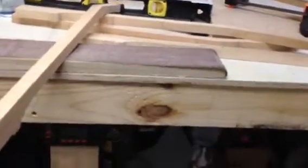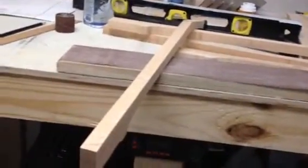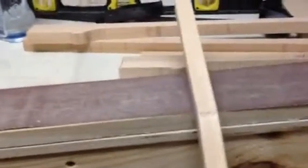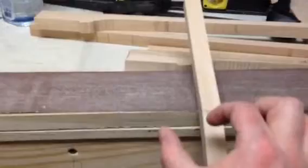Mainly what I want to do is glue all five pieces I cut out together. It's going to be stacked up to about three and three-eighths inches, maybe three and a quarter. That gives me enough room to cut the profile once I stack all these pieces side by side and glue them up — that'll give me a width to draw the headstock out on and draw the taper down along the neck.